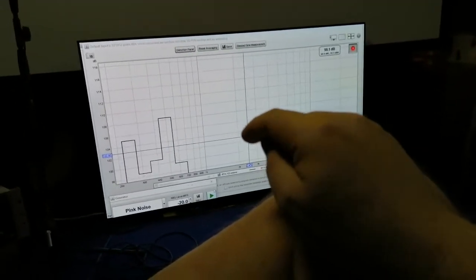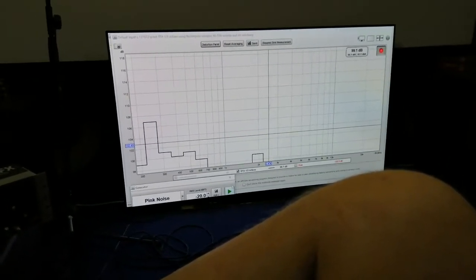So I'll just play the pink noise and then go through the tuning, listening to the frequency range through the horn. Crossover presently it's set at 303 Hertz, Linkwitz-Riley, 24 dB down, so it won't get obliterated with any low frequency passing. Actually, you can tune these HF horns down reasonably low. They do pick up a low frequency down, but it's so far down you ain't gonna notice it too much.